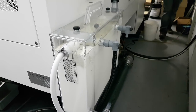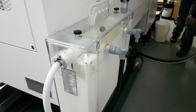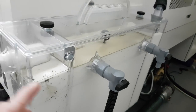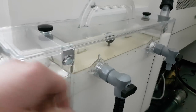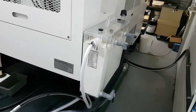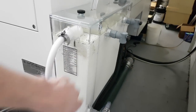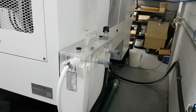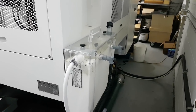Update on the skimmer — we've had this thing on for a day or two now. We haven't even run the lathes, so we're not adding more oil to it; this is just filtering what's been sitting there. Obviously working very well so far. The coolant looks really white, really good. So far, very happy. Check back in a couple of days after we actually use the lathes.